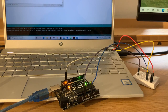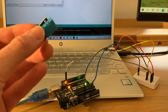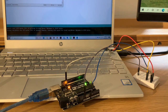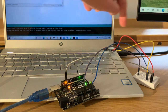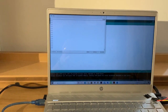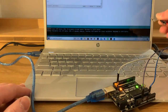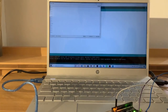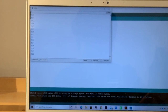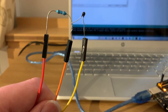There are a bunch of ways that I can measure the temperature of my laptop. I could use a DHT11 module like this, however this doesn't make good surface contact with the laptop so it's useless. What I have set up here is a thermistor and resistor combination and I'm measuring the potential difference across them. At the moment it's showing a value of 500 out of 1024, but if I take this off the computer you should see the value starts to rise. Here's the wiring of the final sensor array — it's a thermistor for f***'s sake.